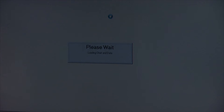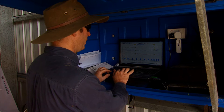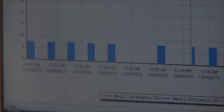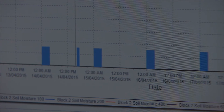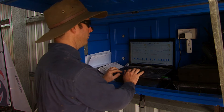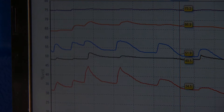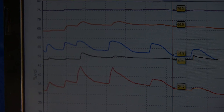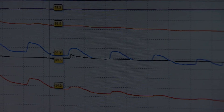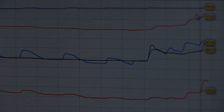I'll just click on block two, which is Q183, second ratoons. Over the weekend, these blue bars down the bottom are the irrigation events — the blue bars are the length of time of the irrigation event, which lines up with the probes' levels. This bottom red line is actually the top level of the soil, so that's 100 millimetres below the surface. The purple one on top is the wettest at the moment, but we can see the irrigation hasn't pushed water past the bottom probe, so I'm not pushing water past the bottom, but we can monitor what's happening all the way through the profile.